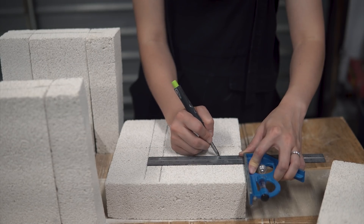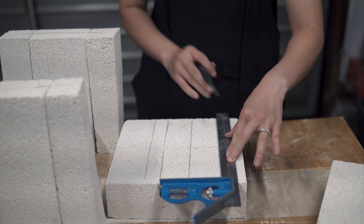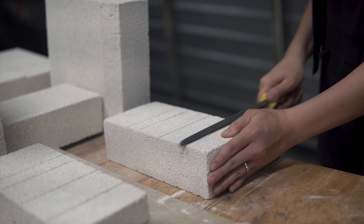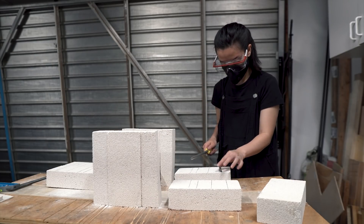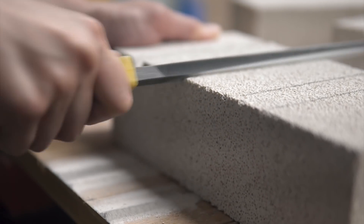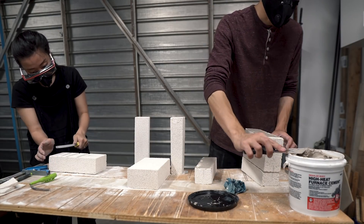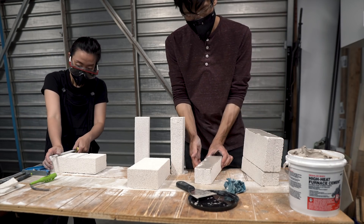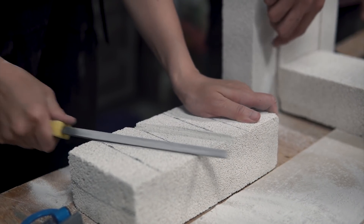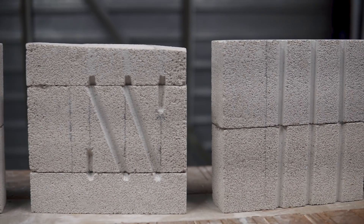Next, we measured three evenly spaced lines from the floor of the foundry to the top rim around the perimeter of the inside. This marked the three rows the electric coil will sit into. Laura used a square file to create grooves into the bricks and used a scrap piece of the electric coil to ensure the correct depth. Meanwhile, I bonded the walls together with furnace cement. Once grooves were made and walls were bonded, we set them aside for a couple of hours to let the cement cure.